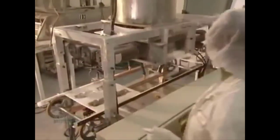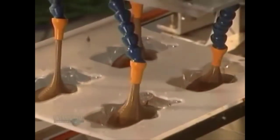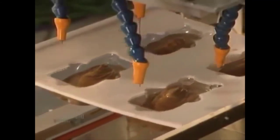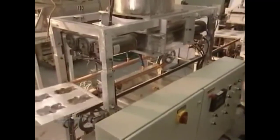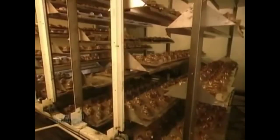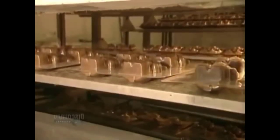These chocolate bears need special decoration applied by hand before the pouring of liquid chocolate. This decoration is made of white chocolate to which a colorant is added. In just one hour they will make 1,200 bears, made by joining two hollow chocolate halves. The assembly is done using a refrigerated rotating machine that turns the molds a full 360 degrees on two axes and vibrates the chocolates to prevent the formation of air bubbles. The chocolates rotate for five minutes before being sent to the cooling conveyor.